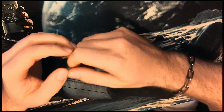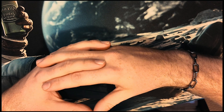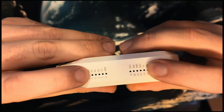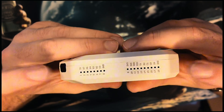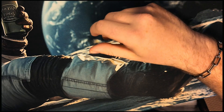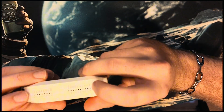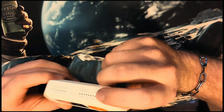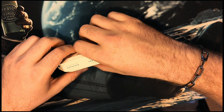A little rundown of what we'll be doing: to control the Flipper Zero I use a UART serial interface that lets them talk directly through GPIO — these pins here. You're going to need female pins for what we're about to do. The TX from the Flipper Zero goes to the RX on the board, RX to TX, and ground to ground. Keep it tight — loose connections lose serial communication.